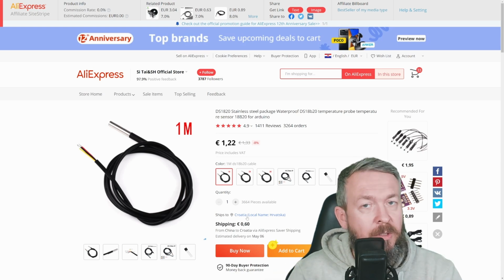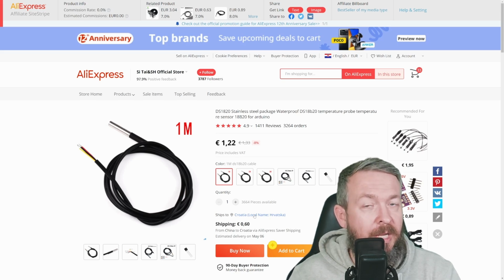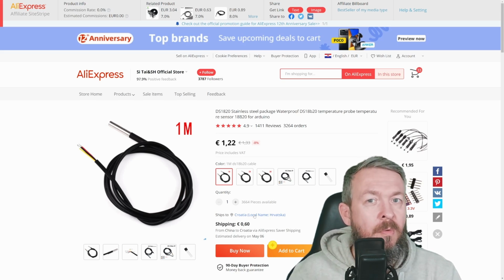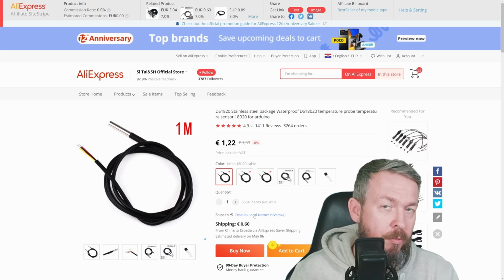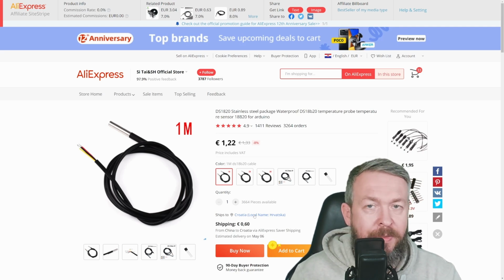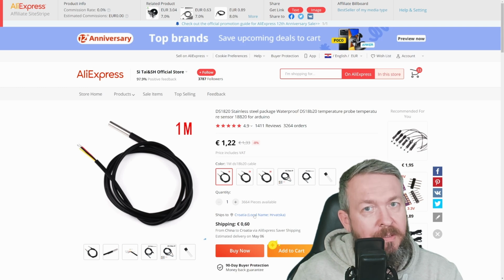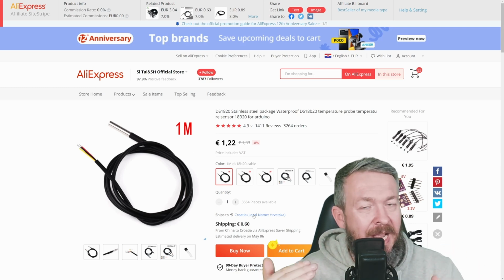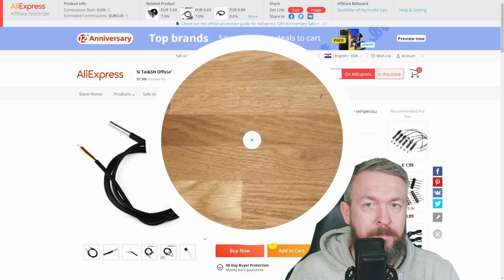There is a difference in temperatures, but I also think that this is impacted on how those sensors are located or where are they located. They are only 20 centimeters one next to other, but the BME sensor is away from the concrete where the other sensor is placed directly. So there is an influence of the cold of the rock or concrete on this sensor, while the other one doesn't have that influence. Also, the other sensor is in a more direct sunlight, so this also impacts. And yeah, I see at least 1 centigrade difference between one sensor and the other sensor.